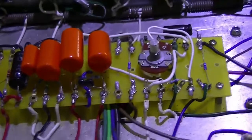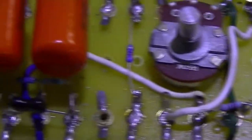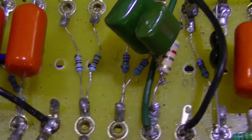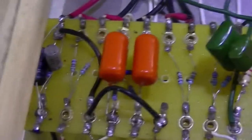Now I'm going to show you something for all you people that tend to spend a lot of time on forums talking about capacitors and resistors and what gets the tone. One thing very interesting about this amplifier is that my mate Tim used little half-watt metal film resistors — some are a bit bendy because he was doing a lot of experimenting pulling out parts and putting them back. Not carbon comp as a lot of people like to use. Does that mean this is a bad sounding amp? No it doesn't — it really, really doesn't. It's a really good sounding amp.